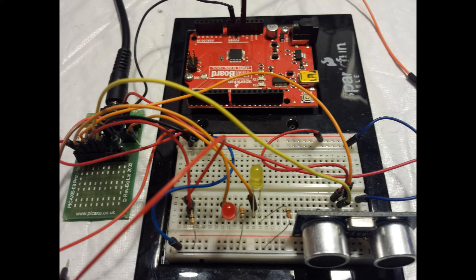Here is the project on a red board. The red board at the top is a project board I bought from SparkFun Electronics when I was becoming familiar with the world of microprocessors. I would highly recommend starting out with a simple project kit. Right now its only purpose is to supply 5 volts DC to the PICAXE project. To the left you can see the PICAXE prototyping board, and although you can't see it, the 08-M2 is in there. In the front is the ultrasonic ranger. The red and yellow LEDs are being used to simulate the lighting. The relays are not necessary right now.